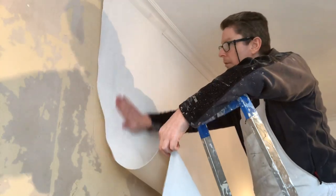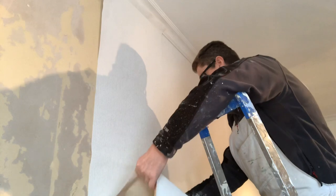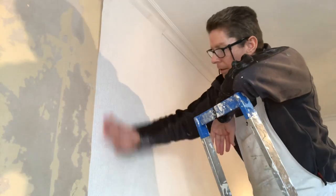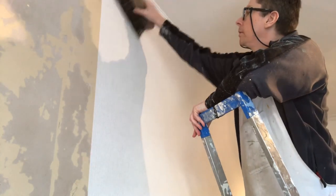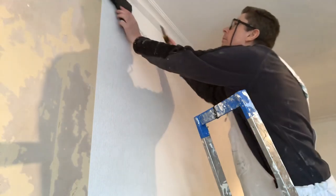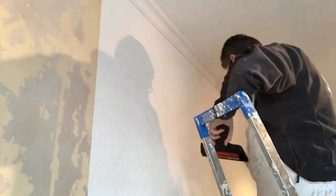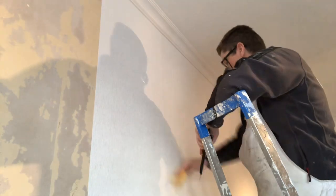Put it in just there. I'll lower the camera shortly and show you what I'm doing around the fireplace. Paper and brush — tuck it into the corner there. Straight edge blade, and just trim your paper. Sponge off the excess paste. Simple as that.